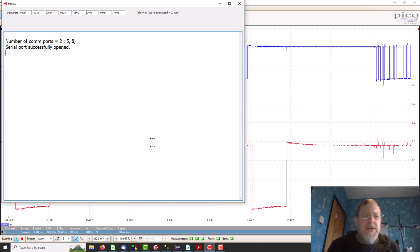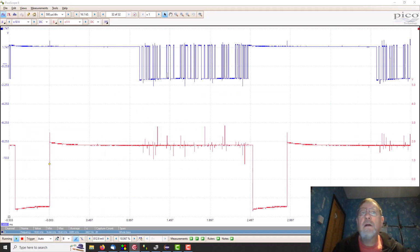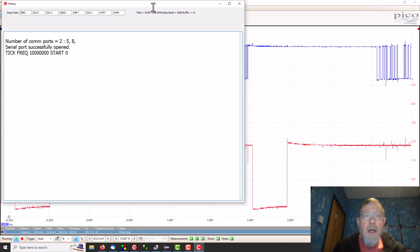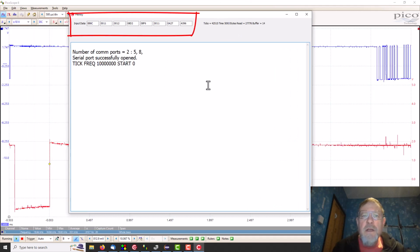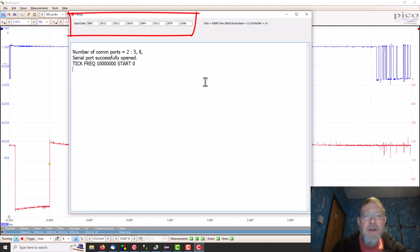So I think we need to have a look at what is coming out of our rotation sensor and our strings. So I will have a think about how best to look at that and assess it, and I will bring you back. So let's have a look at the PC program and see what we are getting out. Run. Here we are. So yes, there are numbers coming out, but as you can see, it's quite jerky. They should be spraying numbers out continuously, well, once every 3 milliseconds, though the display won't update.